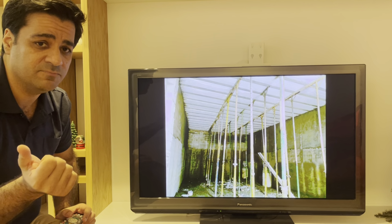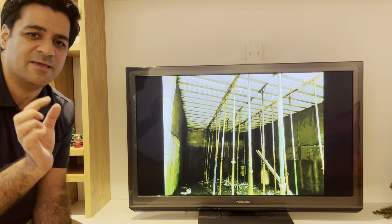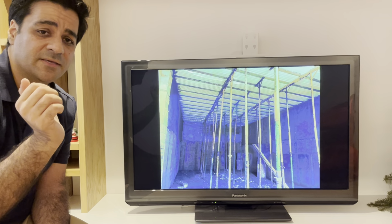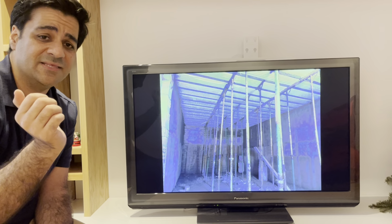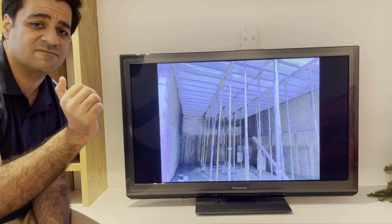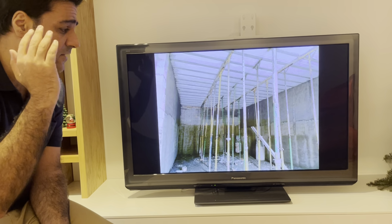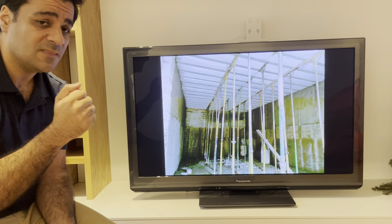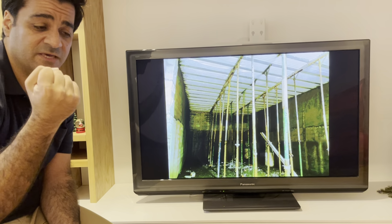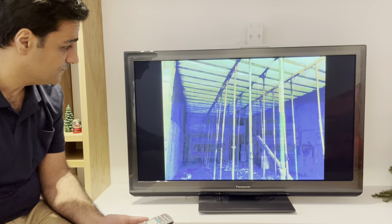Even in India, even in the warmest region, you can control the temperature in summer or autumn, because for growing saffron indoors or growing mushroom, we need a temperature around 25 centigrade in summer, at the beginning of autumn 20 centigrade, and in the middle of autumn the range of 14 to 17 centigrade. These are the reality, and you should be aware and control the temperature in this environment. The specification of the building helps you have the best structure.